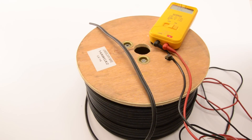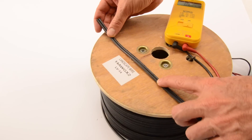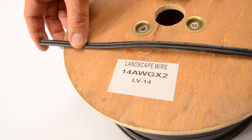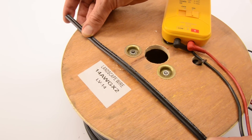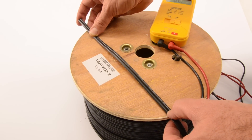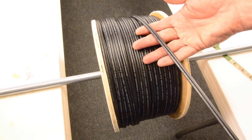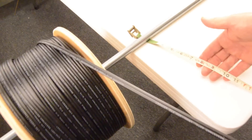Today we're going to talk about low-voltage lighting LED voltage loss. We're going to use a 14-gauge cord — this is a low-energy direct burial 12-volt cable designed for landscape lighting. People are used to using 12 and even 10-gauge wire for landscape lighting because of voltage loss, since old-style fixtures require a lot of energy. We're going to unspool 150 feet of it and take voltage readings along the wire to find out what our voltage loss is.